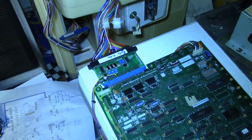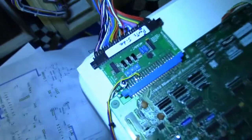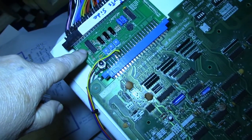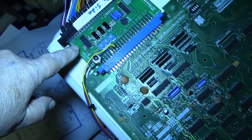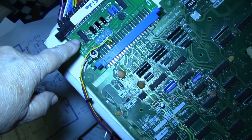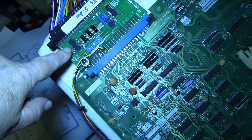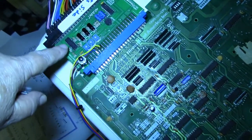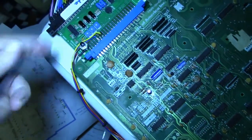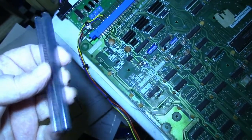But we still want to fix it. So I went ahead and, luckily, the chip that they're using to invert, it's actually an op amp. It does have the numbers on it. They were nice enough not to sand off the numbers. A lot of people, when they build boards like this, will sand off the numbers so that you can't tell what the chip was, so nobody can copy it. Well, anyway, I took the number off the chip and I ordered some spare chips.